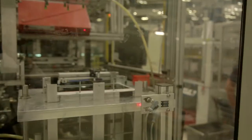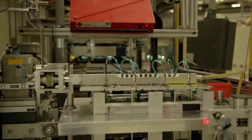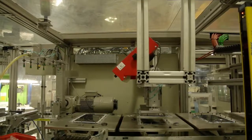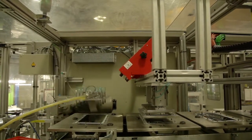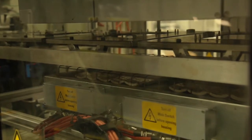The forming process is where we take a flat tile with pre-cut holes and put it into a forming machine to turn a 2D product into a 3D product. The first part of the process takes the tile from a feed unit and places it onto a pallet into the pre-cut holes. The next stage, the pallets move forward and we stamp the tile onto the pallet. From there the tile continues through the machine into the heater section, which heats the tile up and makes it pliable so it can be formed.